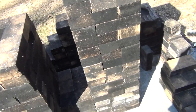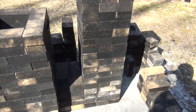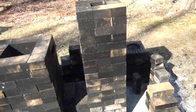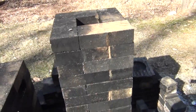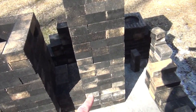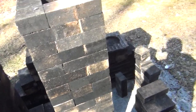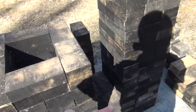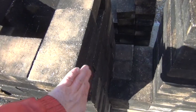But in the first video that worked, this riser was directly on here - there was no gap. I made this version with the gap because you need to be able to put a barrel over top of it to heat your house like a traditional J rocket stove. So I had to move it out one full brick, or enough to put a barrel over top. The problem was when I moved the riser - and in rocket stove terminology they call this the burn chamber, which is not necessary in a rocket stove - it ruined my design. The riser was right here, pressed against the side of the firebox.